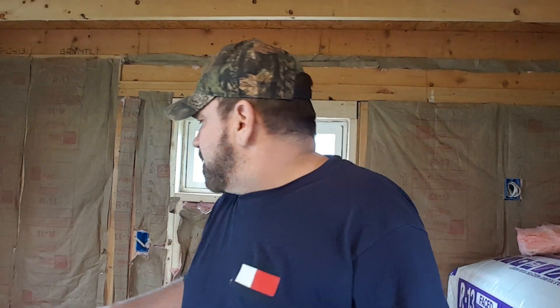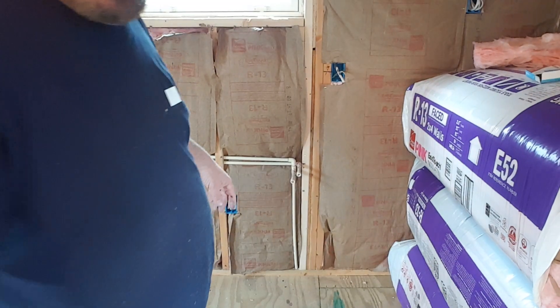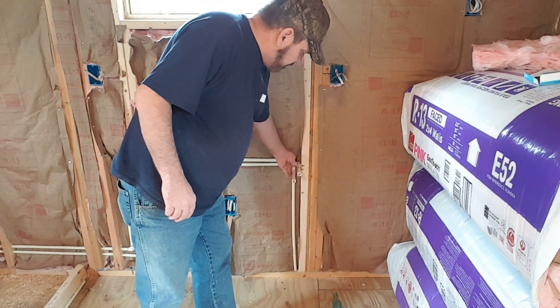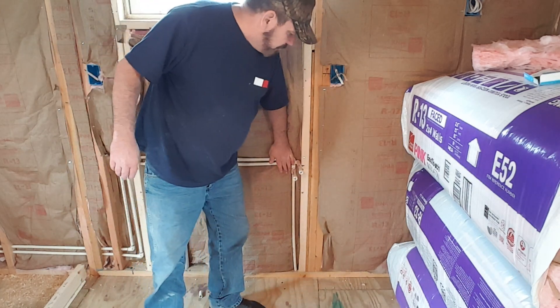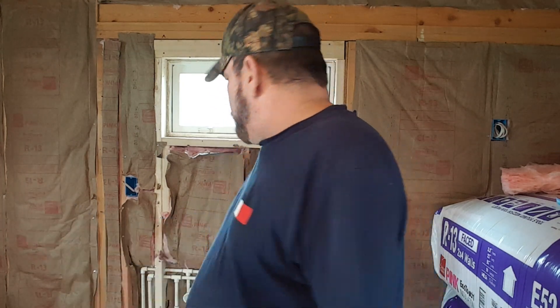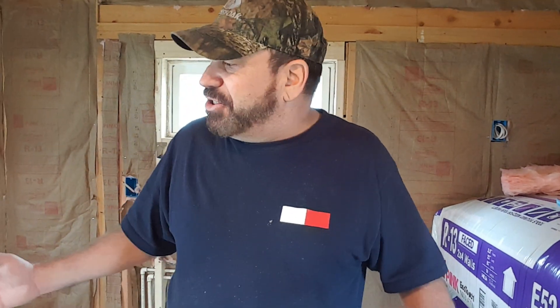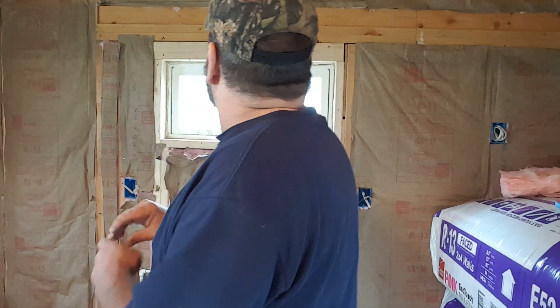It's taken care of. All the insulation is back in place, everything is done. All I have to do is put my clips on the wall to hold where it comes up right here — I'm going to put clips on that to hold it in. It goes back well past where my wall should actually be, but I like to make them secure. I'll secure four, maybe five to the wall, and then that job is done. I'm ready for walls to go up. We have all the electrical in. I still do have to remember a light for up top — that can probably come down from the ceiling, we'll have to see on that.